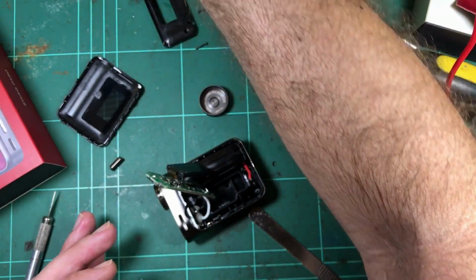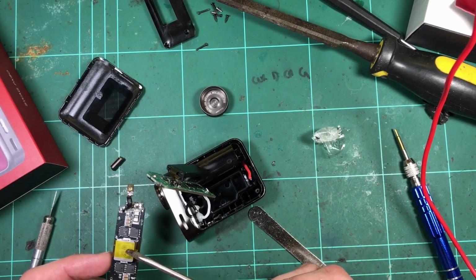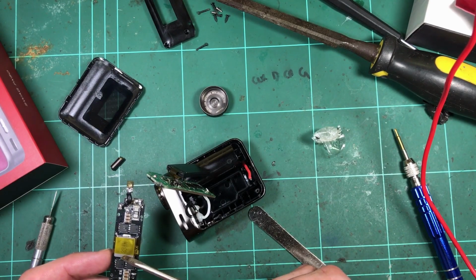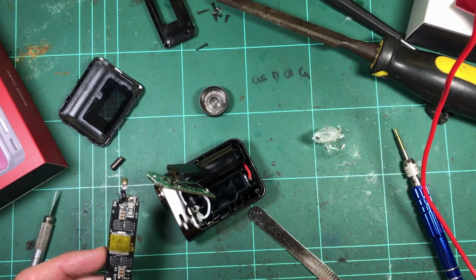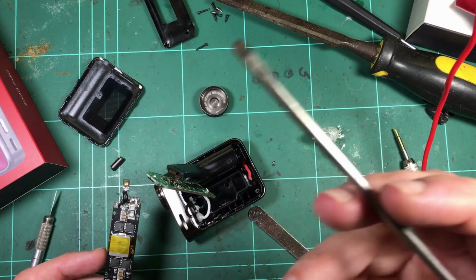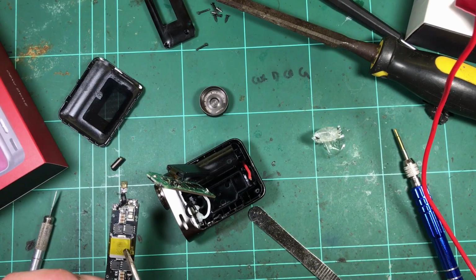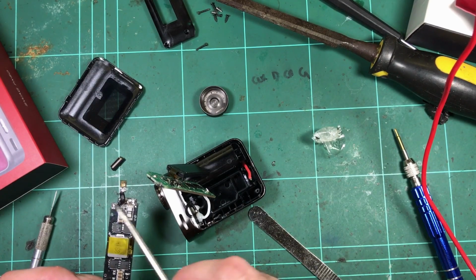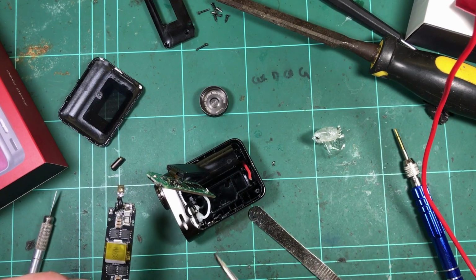When I talk about main inductor, this is an arrangement you normally see with a switch mode converter, where you have one big inductor, some MOSFETs, and then some capacitors, and they form a switch mode converter. You can't really tell, but it could be buck or boost, could be step down or capable of stepping down and stepping up.